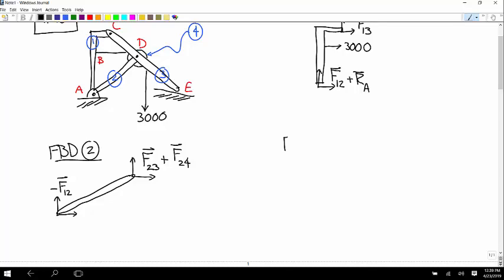And now, free body diagram for number 3. Down at the joint E, this is perpendicular to the surface. So I'll call that the scalar RE with a known direction. We can figure out the unit vector. At the midpoint, it's only making contact with the pin. So this is negative force on 2 by 3. And then up at the top, this is the force on 3 by 1, so negative F1,3.